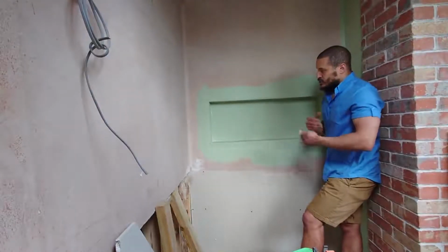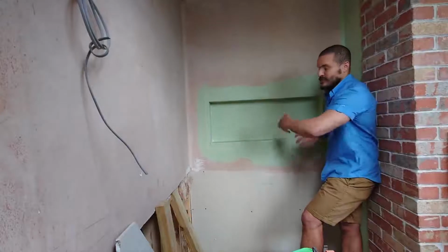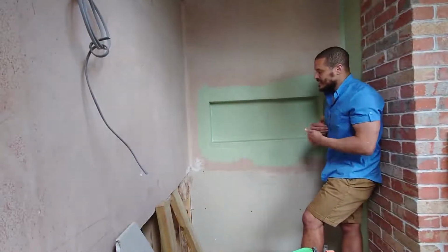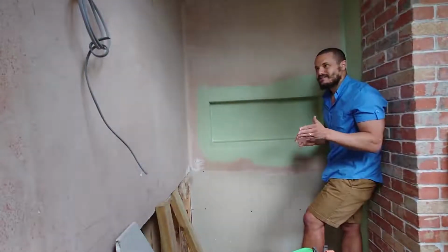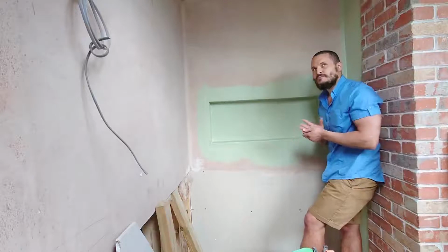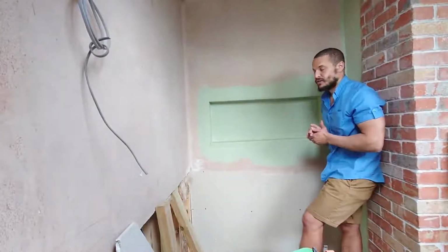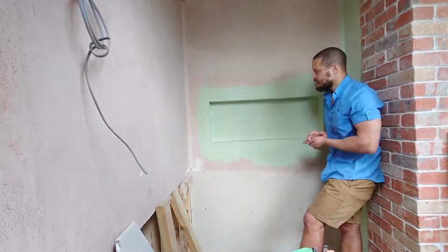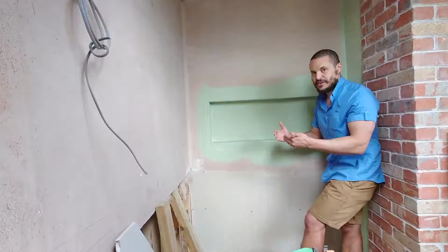So just to recap on the other steps. After cutting through, I then did the reinforcement of the timber. And the next step from there was to add in plasterboard. That isn't necessarily a requirement. I just picked up those notes on a video I watched, which was Home DIY Renovation. I think I got the name wrong, but I will add the link below of their channel and their video on this particular topic. But they suggested building the timber with the correct fall, which I've followed.